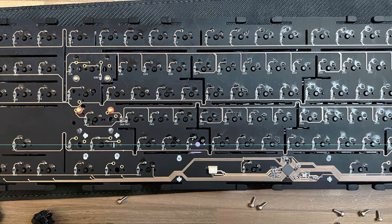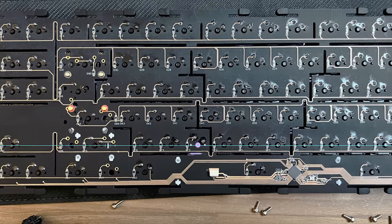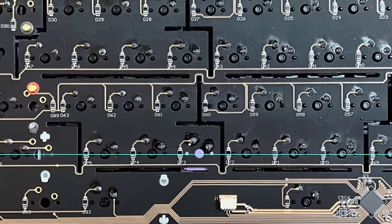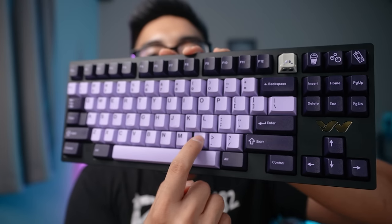I figured I don't recommend hot swap plateless because although it fits and the switches aren't coming out, it's not lined up. Then I built it soldered — I did this off stream right before filming — and I noticed something odd. The holes are not lined up. So the keycap and switch were not misaligned due to being hot swap and lacking a plate, but rather the PCB itself is a little bit faulty — just off axis a little bit, enough for you to notice in the keycap and trigger your OCD. After reflowing and lifting one side slightly to line it up, this is just a manufacturing issue for a prototype, and I will be reporting this back to Oasis so they don't have this in the production run.